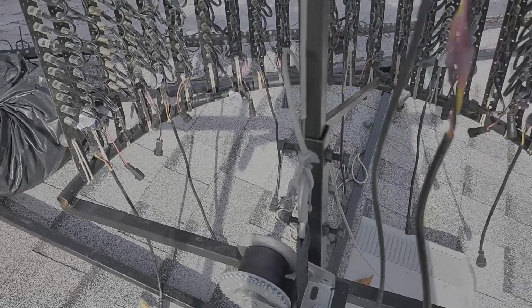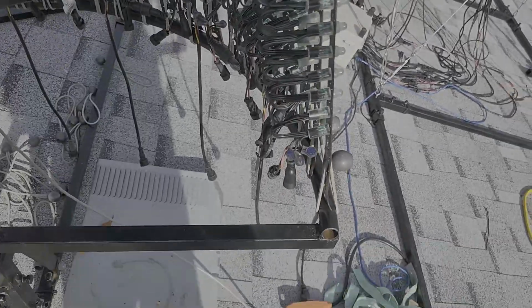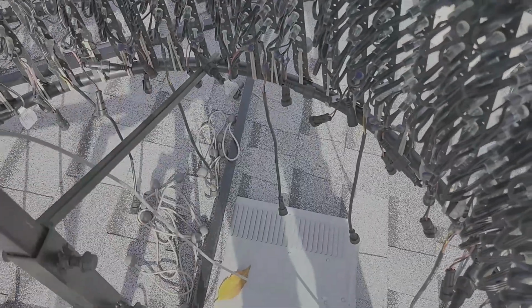So this bottom ring is 33 inches, if I'm not mistaken. It's 1¼ inch steel tube that I bent on my Harbor Freight roller. It connects into a 1-inch piece of 14 gauge steel, and then I have a 1/2 inch piece of brace through the middle. This makes sure that it doesn't lift on the front, and then it's supported here in the back and locked in with these nuts.